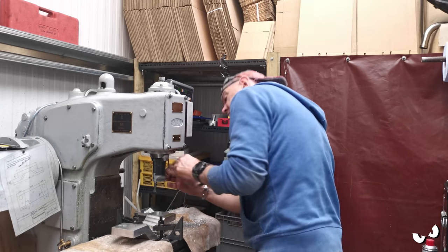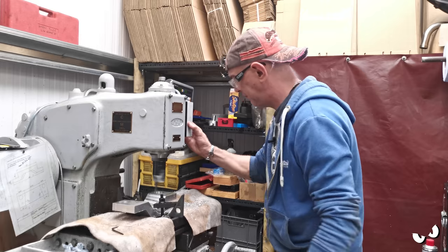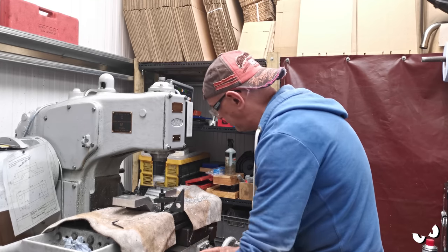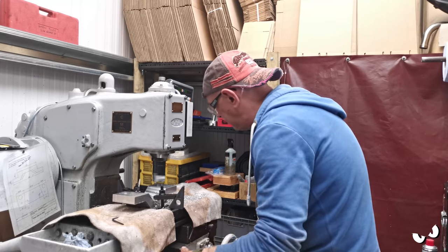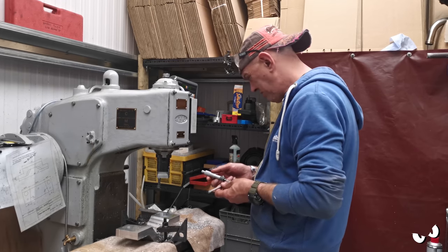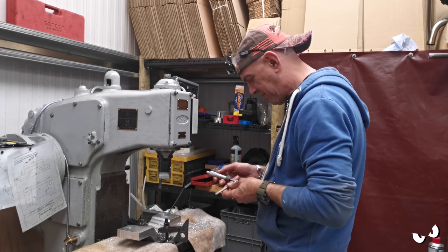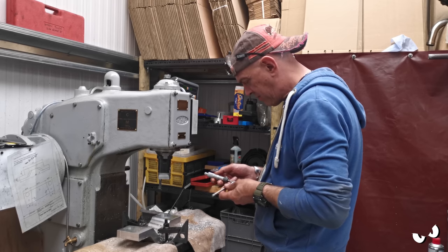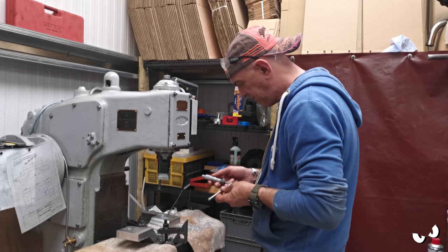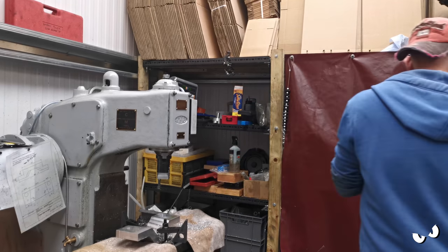Let's start smack on the zero mark. Okay, right. I'm going to do this, measure it, because I'm interested to see what's what. So, took a bit more out of it. I went a little bit more than half mil just so I could get the zero on the hash line there. It makes it easier in my head. And we're short anyway, so that'll be fine. So, we are now at 43.66.